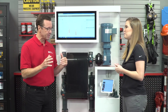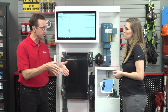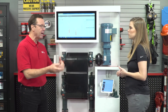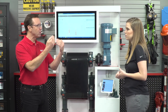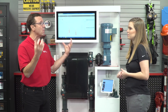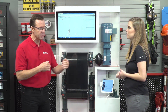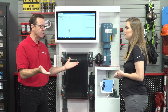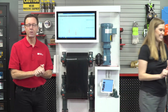In summary: we have the ABB Ability platform, mounted bearings with sensors providing feedback accessible via app or iPhone. The gateway can be used for bigger distances, pushing data up to the cloud so customers can pull it down. Multiple bearings can be monitored simultaneously, and safety-wise, there's no climbing and less unnecessary maintenance — safer for technicians in the long run.